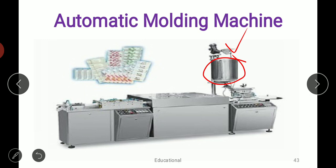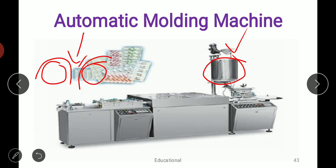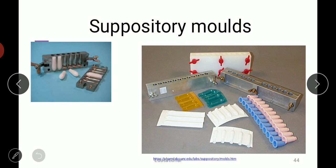The molten mass is passed through to the suppository-shaped part of the machine and suppositories are collected from the other end. In the automatic molding machine method, instead of using molds we can directly apply packaging. Two sheets of suppository packaging run on two different rollers and from the center we pour the mixture of suppository base and medicament, then seal it to get suppositories inside the package.